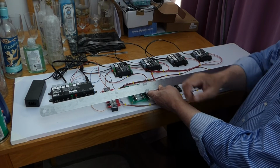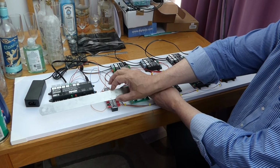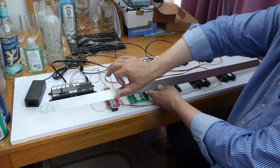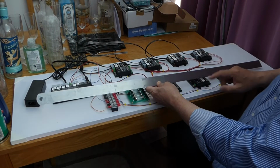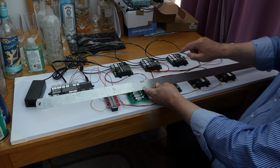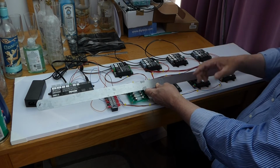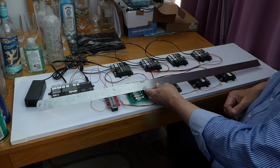Now, my thought is, if this unit is switching the polarity from here, so the train comes in and it switches round, another train comes out and it switches round the other way. Now, with that polarity switching backwards and forwards, and this is a loop, will it affect the whole loop? If it does, that means that these red wires then become the common wires and the black wires become the feed wires to the detection? Which is no good, because they don't actually feed back to the detection unit, so the system won't see where the train is, and will it cause damage to the units.